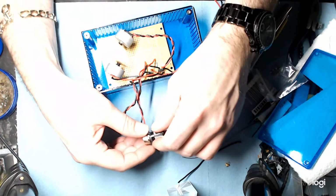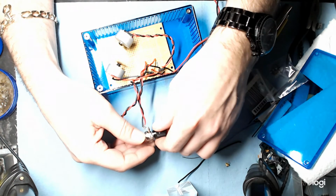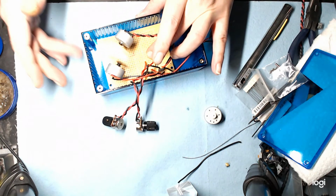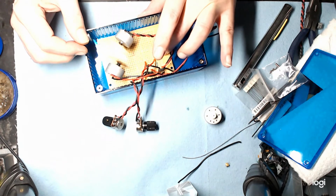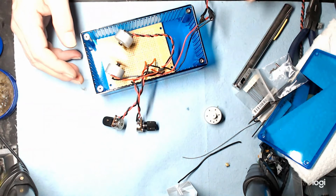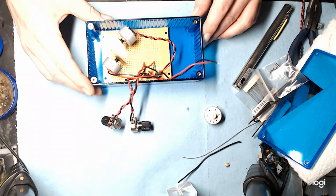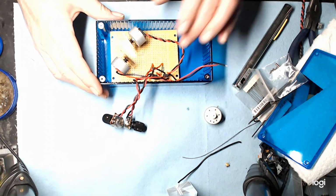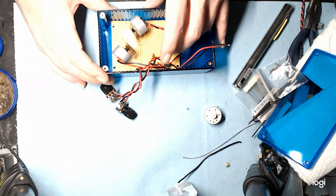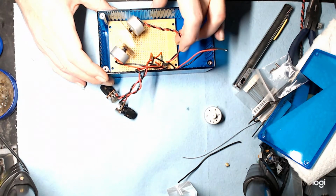Our exit's going to be somewhere around here, but we're not going to cut it. The trick with any type of laser project you put together, wherever you have an output beam, don't guess it and start cutting holes. Rather, what you want to do is, I'm going to lift these up. There's a little platform I'm supposed to sit on. Get everything put together first. That's number one. You get everything set, your laser glued in place. You don't want to change things around afterwards.